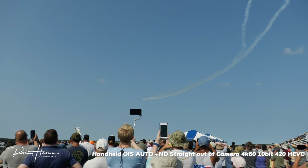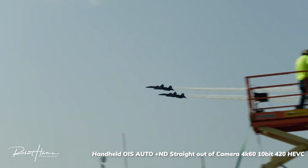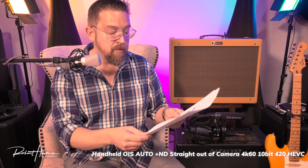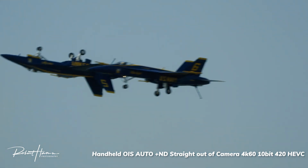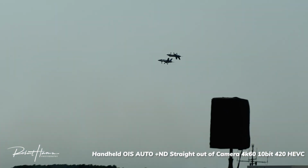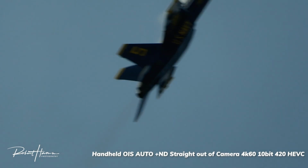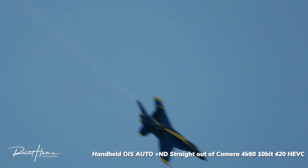It's actually a little bit larger sensor, going over 20 megapixels in some of its readout modes, but the instruction sets allow that frame size, that window size, to be adjusted based on the needs of the manufacturer or the OEM that's buying it. In this instance, readout mode number 2 and 2A both give modes in 15.2 megapixels with a window size, a frame size that's just slightly larger than Cinema 4K. Now, if you take out that Cinema 4K size, you'll find 15.03. And that's exactly the size of effective megapixels in the CX350, right? And because of that, I believe that this IMX 204 is the sensor being used.